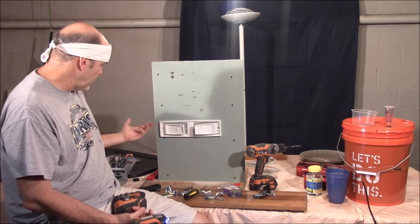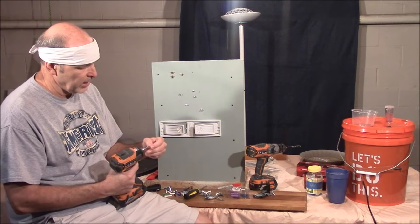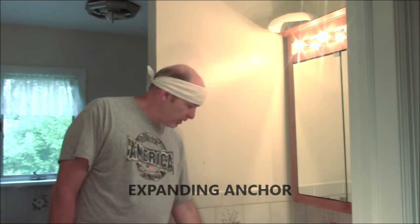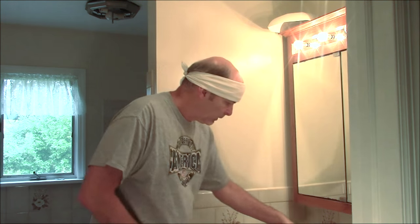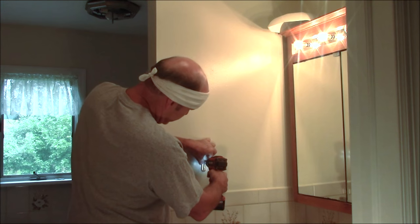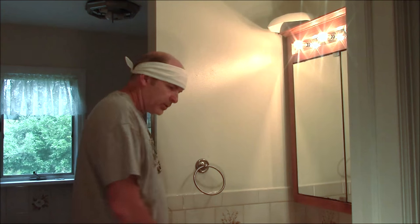That's pretty tight, then I'd put the other side in. I'd always generally start with a screw because you might get lucky and hit the wood — and in that case, I happened to hit the stud, so I'm good to go. Now that we have the basics, let's go hang something. I'm going to use the wall shield that came with my towel bar. Drill the appropriate size hole — your instructions will tell you the size — then press or tap in your wall shield. Now you have something the screw will bite on. Make sure it's plumb, tighten up the screw, and you're good to go.